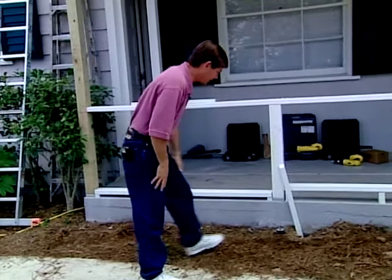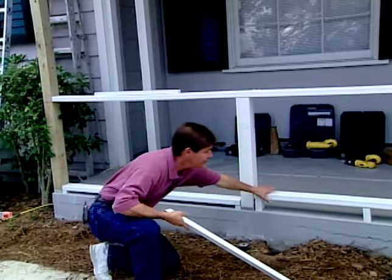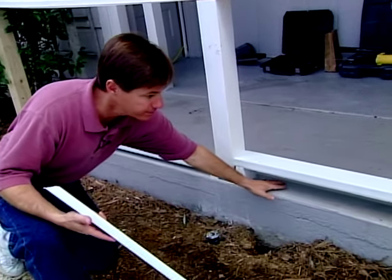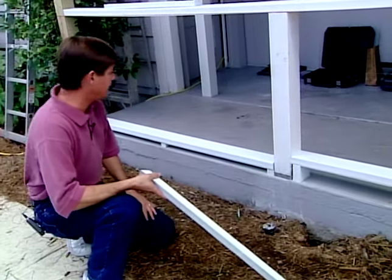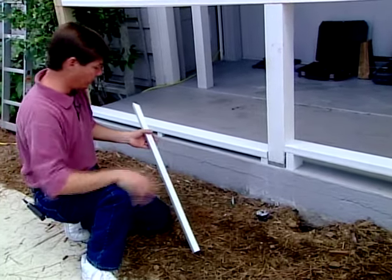Look down here at the base. Help us make this decision. We were talking about raising our bottom rail to, number one, let air, water, and trash be able to remove off the porch. Well, we came down with a lower piece that kind of looks better, I think. And so that's kind of one decision to make.